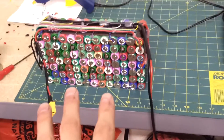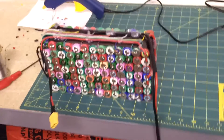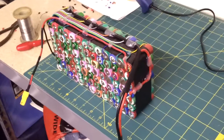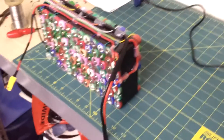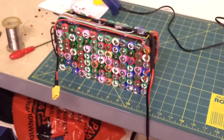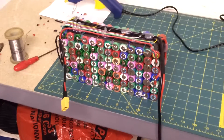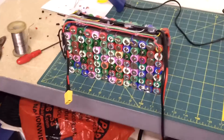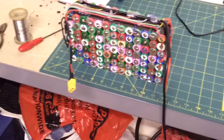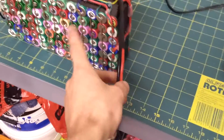This was always a risk — I've used old, used cells from laptop batteries. So I stopped it there, took it off charge, and I've kept monitoring it after that. It dropped only very little, to be honest, and it settled out at around 53.2 volts or so. That was more than a day ago — about a day and a half just sat — and it settled out perfectly well.